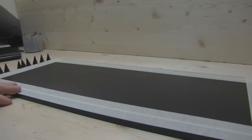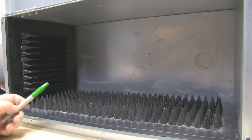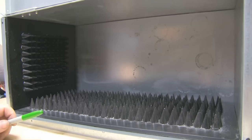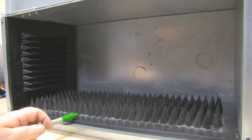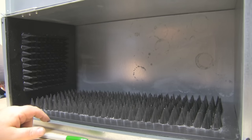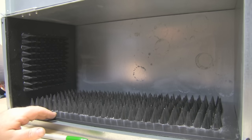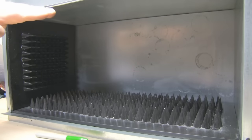I'm now thinking about where to drill the holes so I can lay down the coax. I've already decided to use semi-rigid coax, so I'll have a connection at this end, one in the middle, and one at the other end. I've cut down the bottom tile first and got it in place, and I've used a marker to mark off where I need to drill the three holes for the three SMA connectors through the enclosure.